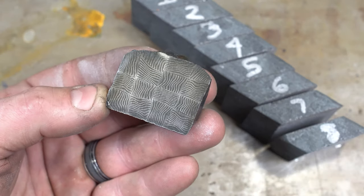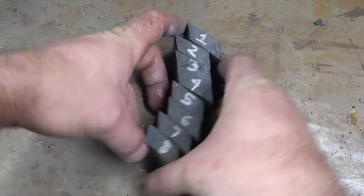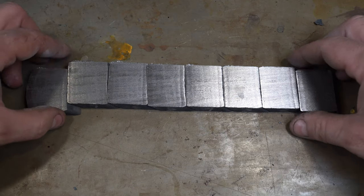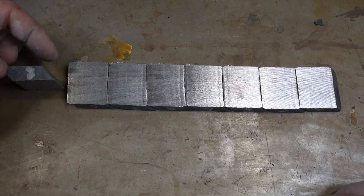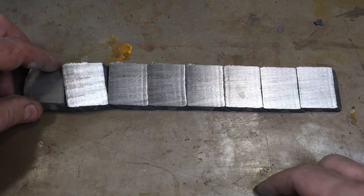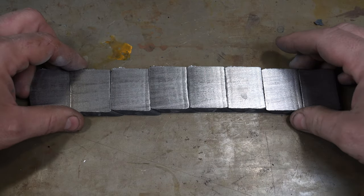So there's a little test etch. This is the end piece, so the layers aren't quite as straight here just because it's an end — I'm sure in the middle it's going to be a little better. So we've got our billet all sliced up. Now we're simply going to restack it, keeping the numbers all aligned. We've got eight full slices excluding the end pieces, so that's really good. Now what we're going to do is use our tilting rest — we're going to tilt the rest exactly at this angle and clean up all of these connecting areas. The reason we do it on an angle is that when we press straight down, we're actually applying pressure here, so that will join and fuse and forge weld these together.